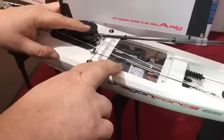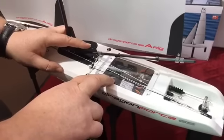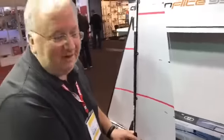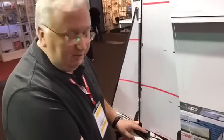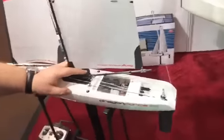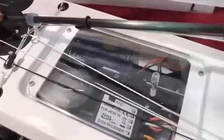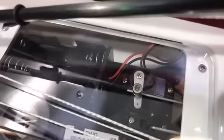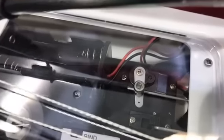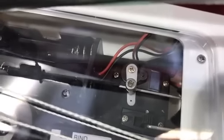The winch is the same winch we've always had — no performance gain there, but it's generally a reliable item so no need to change it. The rudder servo has proved inconsistent in the past. This is a new digital rudder servo with about 10% more torque, a new motor and a new circuit board, so we're hoping it's a more reliable servo than the older one.